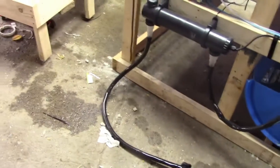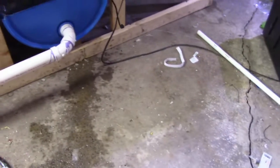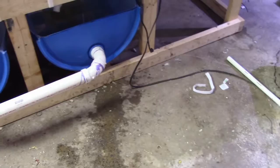But also I have a lot of friction to deal with. Seeing I'm using the full, these are 10 or 12 foot 2x4s, that's completely making contact with the ground the whole way. That's a lot of friction. So even 200 pounds times all that friction is a lot of weight to try to move. So I had to get it up on rollers, and shifted it over a couple feet.